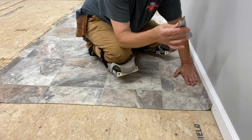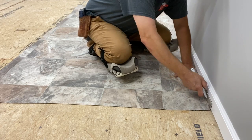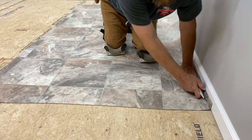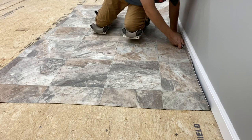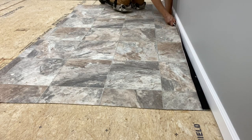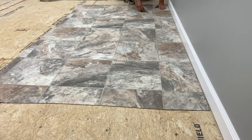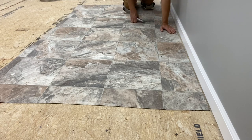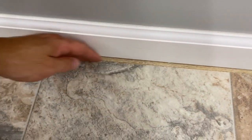Now this is the disadvantage to these typical utility knives. You always have to make sure that you push down on the vinyl. When you pull it, you're actually pushing down, down, and back at the same time. It's not really a big deal. As I was coming down through there, because I'm actually pushing down and pulling back on the knife, it started to get away from the vinyl floor back here just a little bit. It started running away from the base just a little bit.